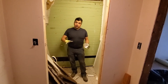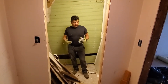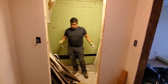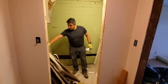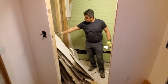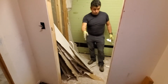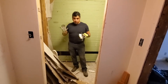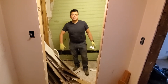We're going to continue, and remember to wear your glasses and mask — half an hour into this work there's a lot of dust and you'll get suffocated without protection. With bigger pieces of drywall, we're not banging them; we're trying to dismantle them whole. Then smaller pieces you can chop down and put into the trash bags. Those are the tips to stay efficient and not wear yourself out by the end of the day.